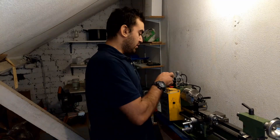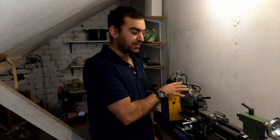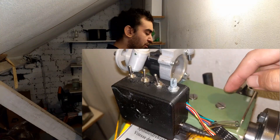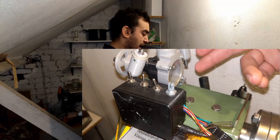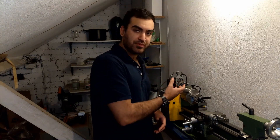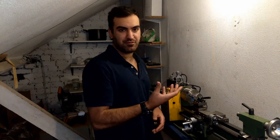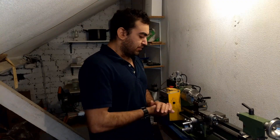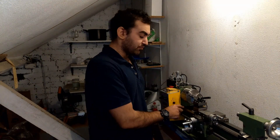One of the first things I did when upgrading the lathe — when I was changing the spindle bearing — was add two points at the top of the block so I can lubricate or put grease from the top. I mostly use oil rather than grease, because grease wears out and just remains in the block and becomes slightly messy.